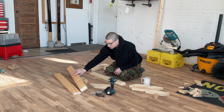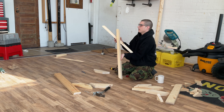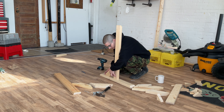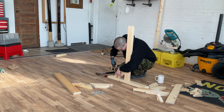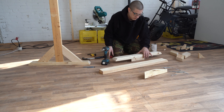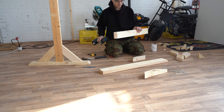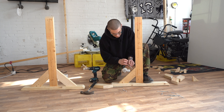And this is where my problems began. You want to mark out the center of your foot section and drill a screw up through the bottom. Use that screw to mark the center of your leg post and drill that sucker down. Then add your supports. At this point, the extremely dried out alleyway lumber I used for the supports and my extreme stubbornness finally caught up to me. Since I was refusing to drill pilot holes — even though I knew that I would solve the problem — I ended up cracking, breaking, and having to recut these pieces over and over. If you get better lumber than me, or just suck it up and drill the pilot holes, you won't have this issue.